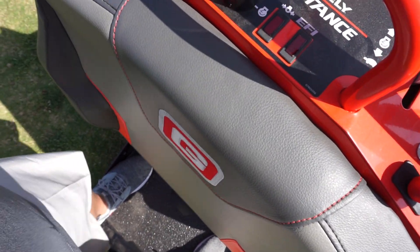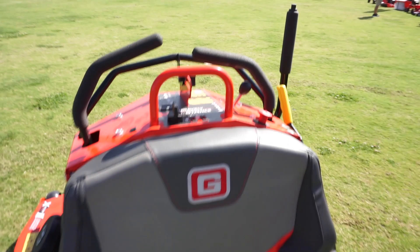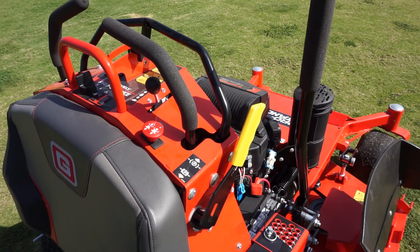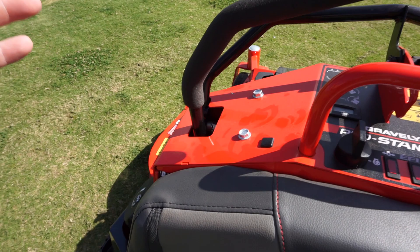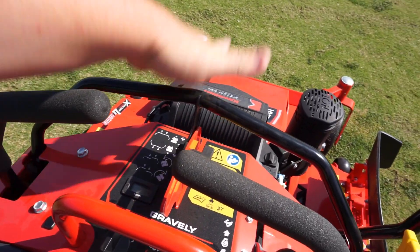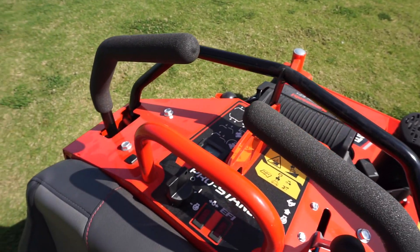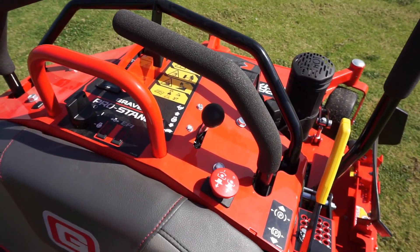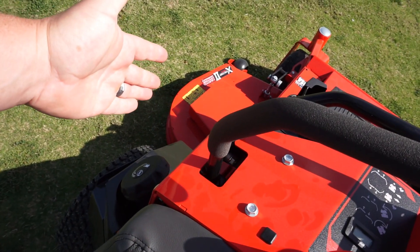I like the way this plate is a lot more than my older ProStance. It's a bigger bucket — you have a lot more room for your feet, a lot more room to be in here. You have a bigger back pad, and you are also moved forward more. So when you're standing on this mower, you're closer to being over the wheels, which is going to help your center of gravity out a lot. Up here talking about the controls, you'll notice you no longer have the cogwheel dial for changing the height of your cut, but all your other controls are pretty much the same.